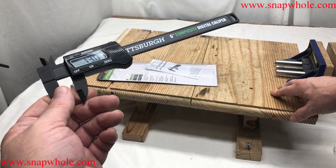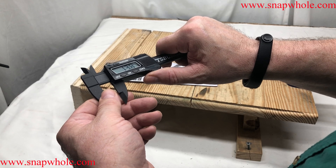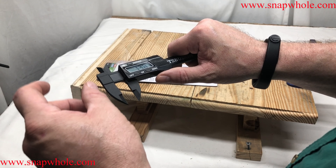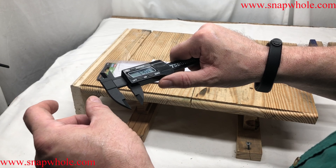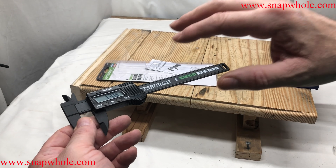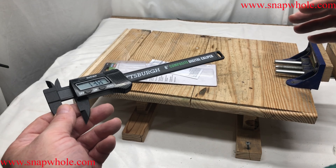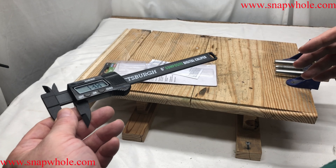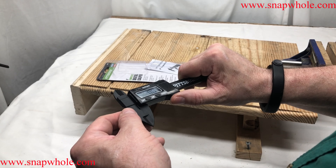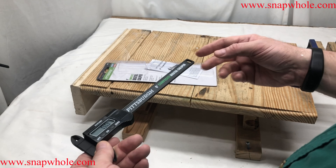Now it is accurate enough to measure for 3D printers. On a 3D printer you want to print a test cube that's 20 millimeters. The problem is if you're off half a millimeter, you will not have proportional prints — something supposed to be 20 millimeters wide might come out 19.5 or 20.5 or 21.5. So something like this comes in really handy because that machine is accurate to about 0.4 millimeters. That accuracy is required there, and you zero it out. They give you inside and outside measurements.